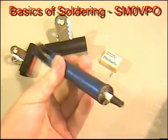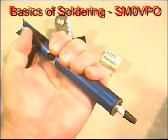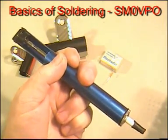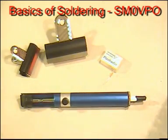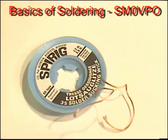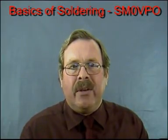The only other necessary tool is the solder sucker, or solder pump — it has many names. This is a sort of spring-loaded tube that sucks excess molten solder from a joint. Do not be tempted to buy solder braid. Unless you are very experienced, the braid can easily ruin a board with surprisingly little effort.